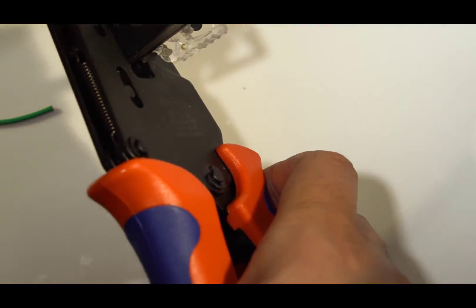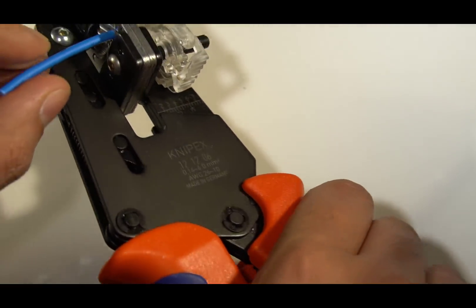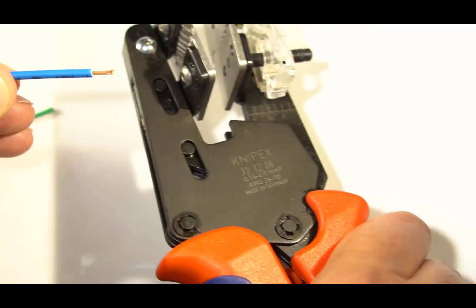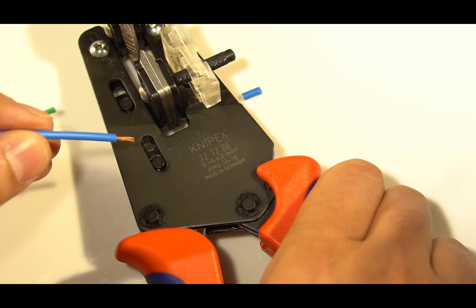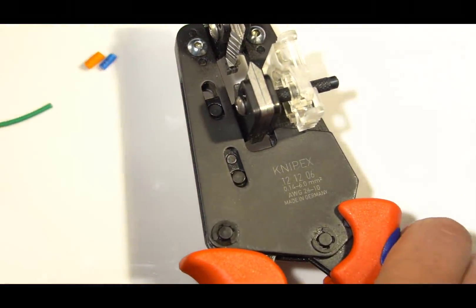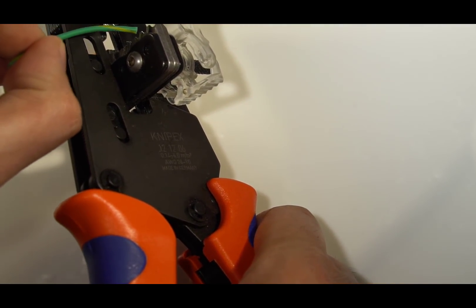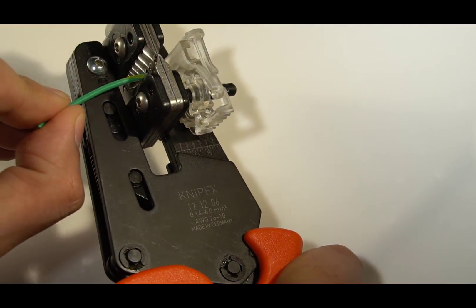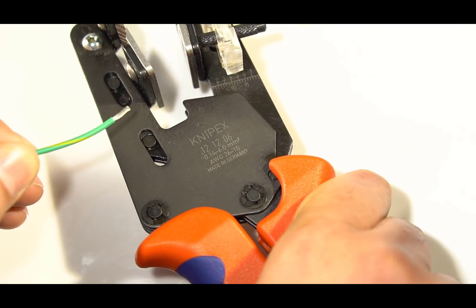Here I will try a 1mm² 18 AWG wire, and this is a 16 AWG wire. For all of these tests there is zero strand loss and I cannot see any wire nicks. In the later tests I stripped the same wire twice at a short length and then stripped the wire ends again at a longer length, which will help to show if there are any marks present.